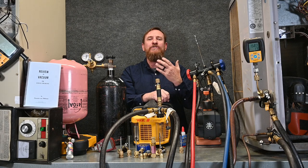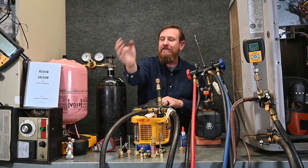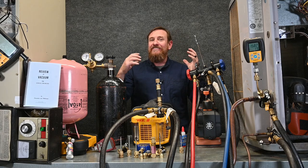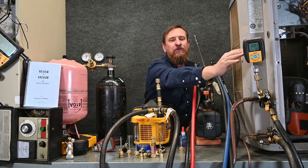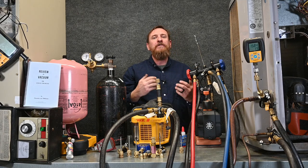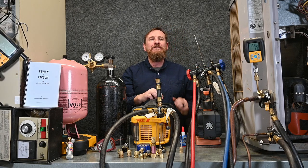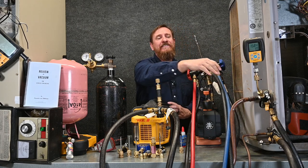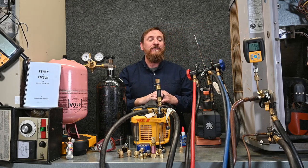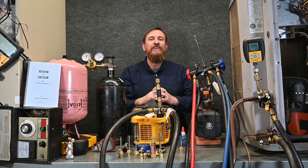So we need a micron gauge or a vacuum gauge. We have digital micron gauges, which I love, but microns are not new — this is my first micron gauge, which is an analog gauge. Digital microns are the new thing, and it does make a huge difference. I like to put a valve between my micron gauge and the system. What I found was that doing pressure testing, flowing, and adding refrigerant pushes all the oils from the system into the micron gauge. Ever since I started using a valve between my micron gauge and my system, I haven't had to clean my micron gauge not one time.